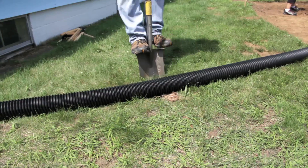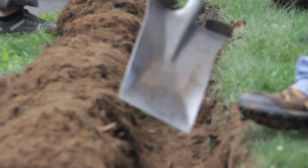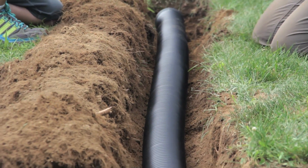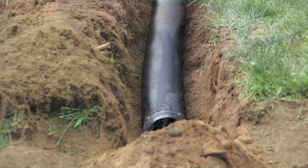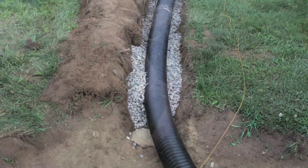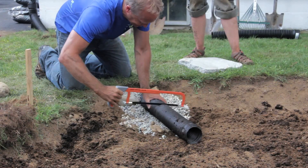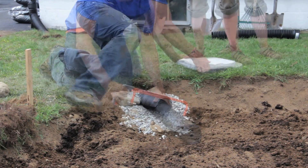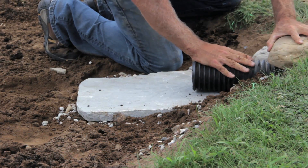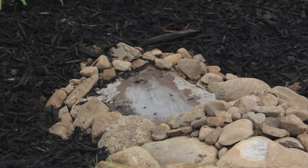Now it's time to focus on the inlet and getting water from the downspout and into the garden. For this project, we extended the downspout and buried it in a trench. Being careful to remove the sod, we extended the downspout using corrugated plastic, then used crushed stone and a level to achieve sufficient pitch to drain the pipe into the garden. Once in place, the pipe can be buried and sod replaced. It is a good idea to place a flat stone or crushed stone where the pipe enters the garden. This helps slow the water down as it enters the garden and prevents erosion at the inlet. It's also a good idea to test the inlet to see where the water flows and to make sure no channels form.